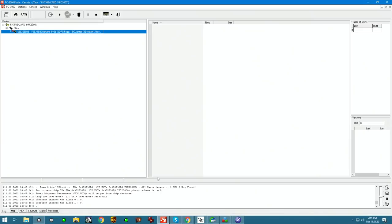If we can solve one card, we can probably solve all three. So reading that chip out yesterday did produce some good news and some bad news. Good news is that we can see that the XOR for the user data is static, but we also have XOR in the service area. Service area is where the information about block numbers would have been kept, and without it, we can't build our block sequence to get the content out. So luckily for us, the customer had supplied a few working cards as well that are the same.